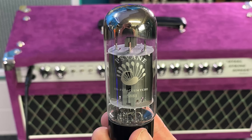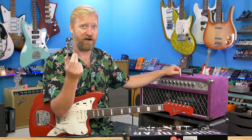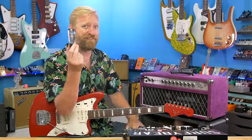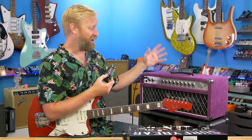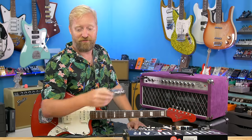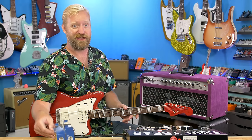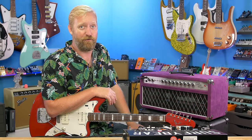5881. So if you're shopping for one of these, when you contact them, tell them to put something else in. Bendy says that he's in contact with the factory and he's telling them not to use these tubes anymore. I had these replaced with JJ's. I've played with it probably a good 4, 5, 6 hours since getting it retubed and biased and all that stuff and have had zero issues whatsoever. It sounds great. It sounds full. It sounds warm. I've had no hint that anything is going on.